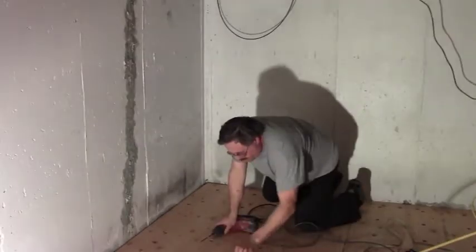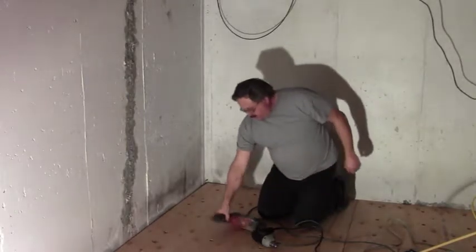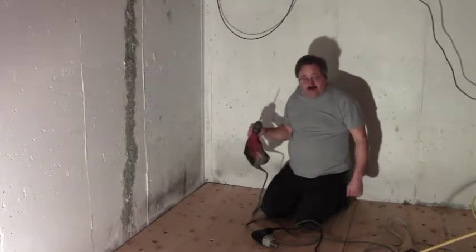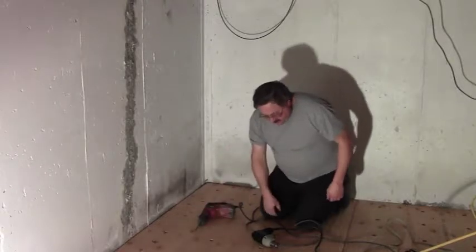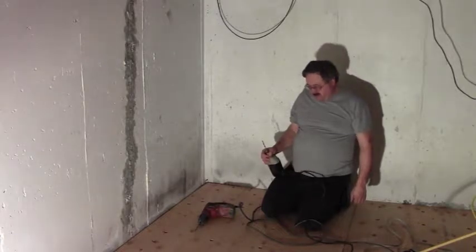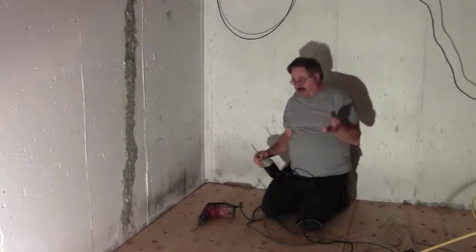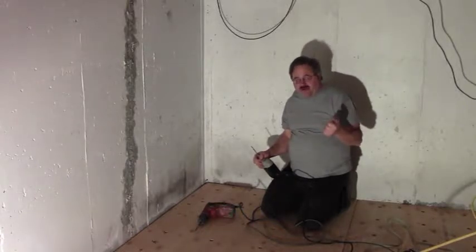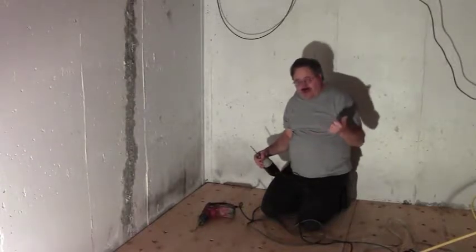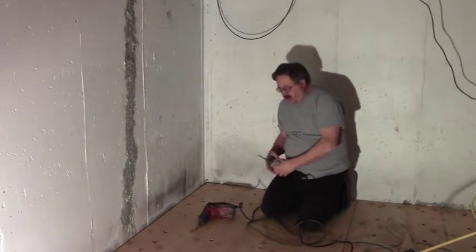Okay, now it's time to pin this thing to the floor, and I've got a couple of different drills here. I've got a concrete hammer drill with 1/4 inch bits so I can make holes for my Zamac pins. I also have a regular drill, and this is just to go through the rest of the wood. Things are piloted with the tip of the spade bit, and this will go the rest of the way through the wood and through the styrofoam underneath until we get to the concrete.